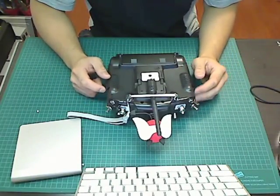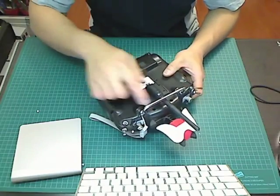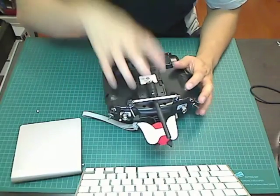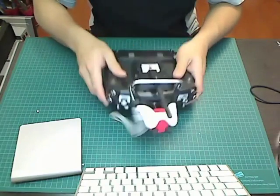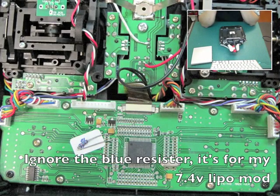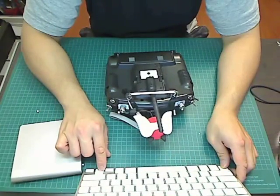To do this mod you'll need to take apart your Flysky 9x or Turnigy 9x. Take out the batteries, then unscrew the six screws on the back shell. Detach the wires connecting it to the front. The main PCB board is visible inside, and removing the black corner screws and five gold center screws will reveal the LCD screen.